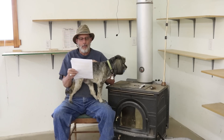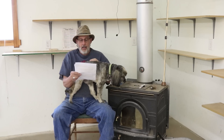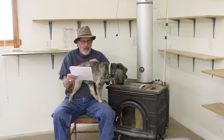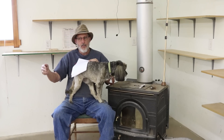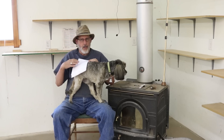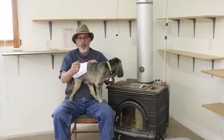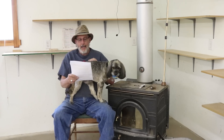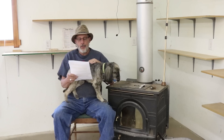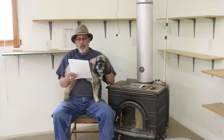Glenn Cam — I keep wanting to say Glenn Campbell — says, 'Good basic router table Sam. I would have made slots at both ends so the fence is parallel with the router track.' I looked at that and I'm not sure I'd ever use the miter gauge in the slot in combination with the fence — they'd have to be absolutely parallel. On one end of my router table I just have a hole drilled through with a nut and a bolt that pivots, so it doesn't always end up parallel with the miter gauge. He also noted a dust collection port on the fence might be useful down the road, and gave a good tip about waxing the fence.